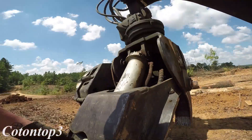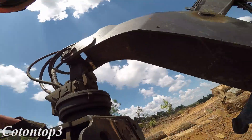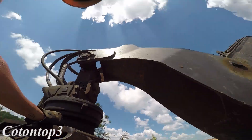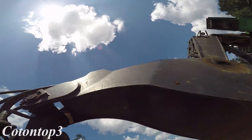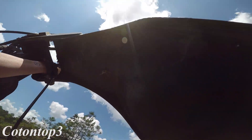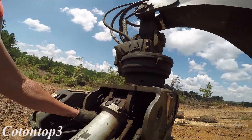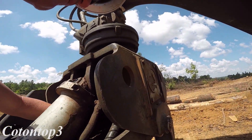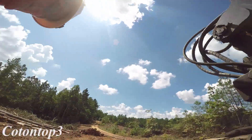We like to hand pump it because you can feel it — you know what's going on. You can tell whether the grease fitting is taking grease or not, and you're not over-greasing and wasting it. It just works better for us. A lot of people probably disagree about that, but that's just how we roll.